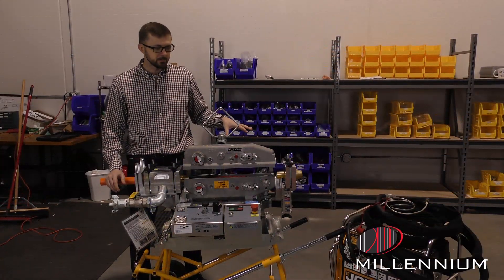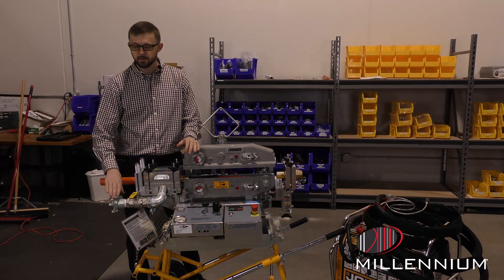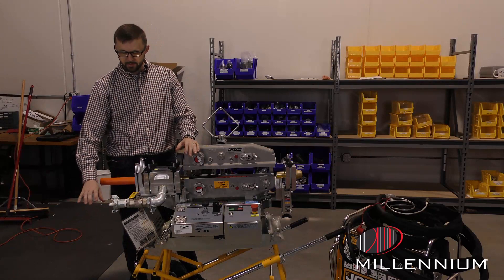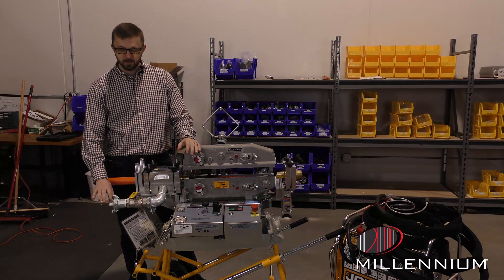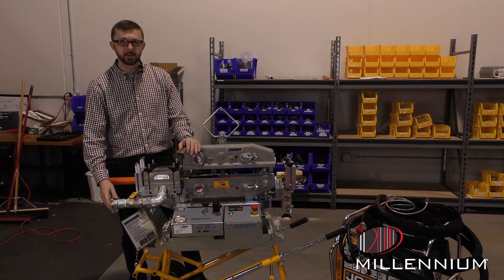After you've got your hydraulics and the shutoff switch hooked up, next you're going to want to hook up the air from the air compressor. This is a four-claw Chicago fitting on an inch-and-a-half hose. You'll press this on and twist to the right to lock it in.